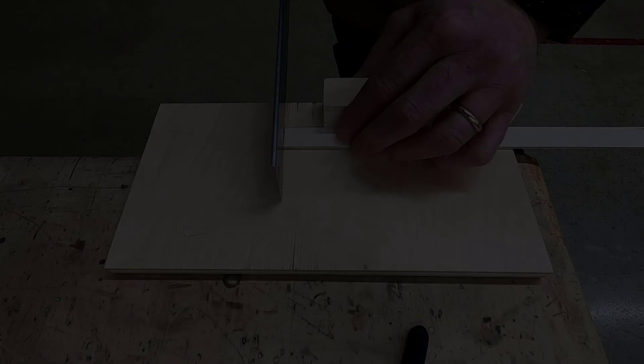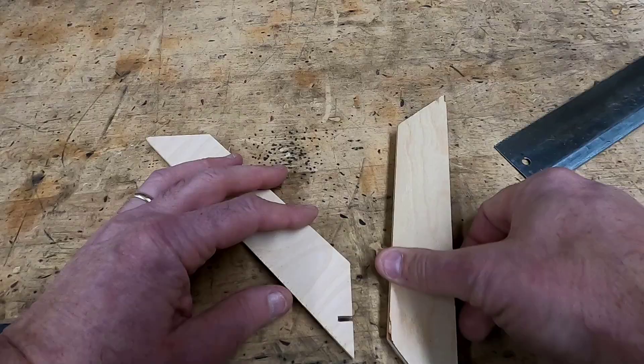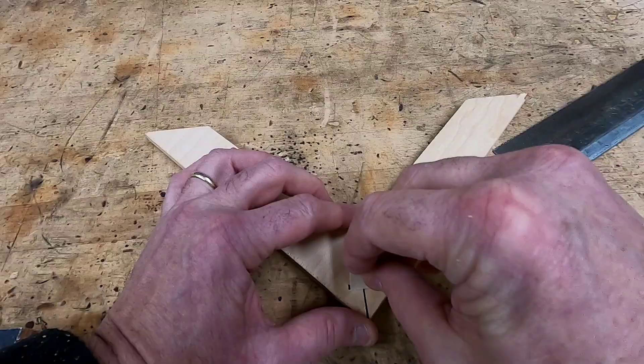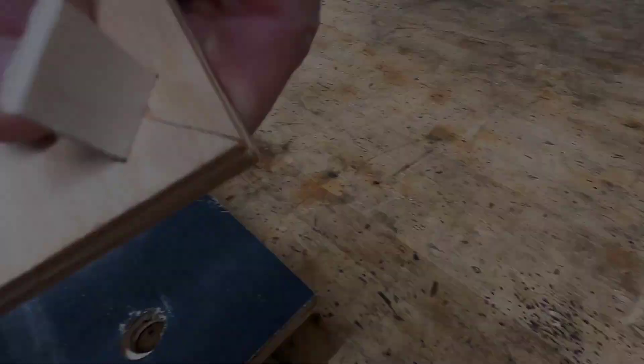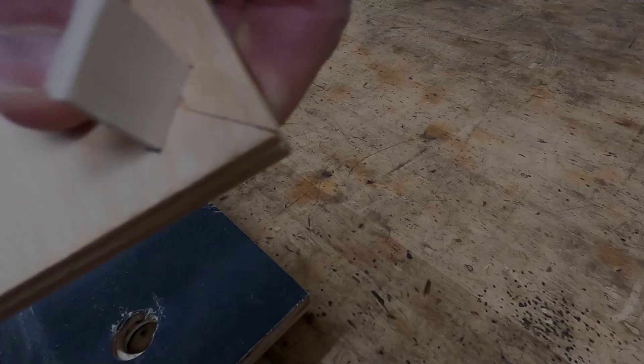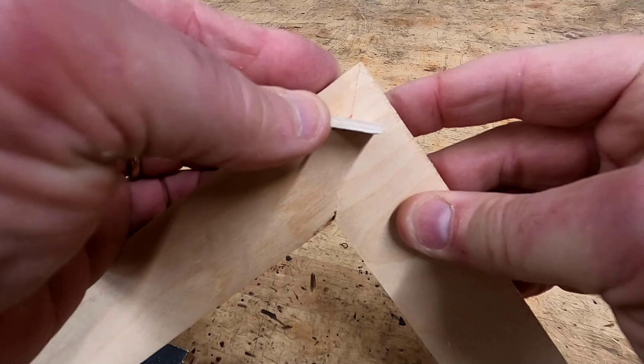On a sacrificial board, using a handsaw, cut a couple of spline pieces. Understand that the splines might be too wide, meaning when you place them into your spline cutouts it will push the miter joint apart. By hand, start shaping the width of your splines, and when your splines fit perfectly between your cutouts, your miter joints should not be pushed out in any way — a nice tight fit.